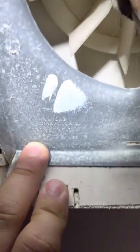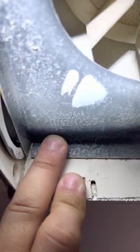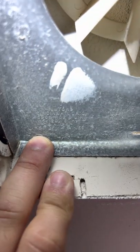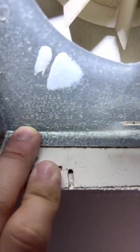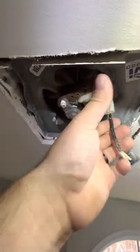The builders are generally only going to put 50 CFMs in, and that's what they did here — and that is definitely not enough for this bathroom. So we unplug the fan motor, and then there's going to be these tabs. We're just going to pop them out. Once you've got them all out, you can pull the whole motor and the shroud out.